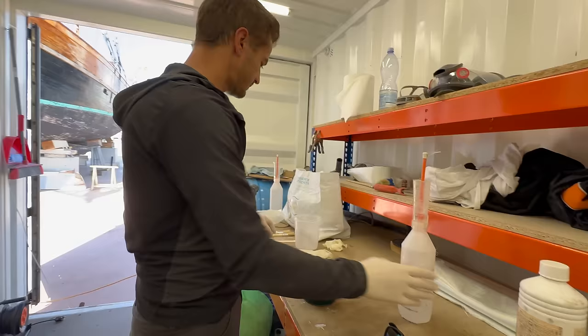To be fair, I think our hull is like 3 or 4 layers of woven roving and then 3 or 4 layers of chop strand in between. It's not very thick. You think there's chop strand in our hull? Yeah, 100%. In between each layer of woven roving there's chop strand. But these 2 layers of biax that we're putting in on top are going to be probably stronger. The 2 millimeters of biax going in is going to be as strong as the 8 millimeters of woven roving and chop strand mat that was in there already, which is kind of funny.